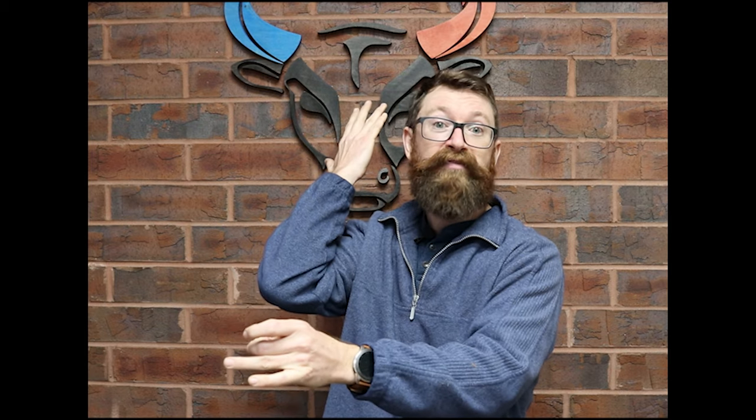So what happens? Either the nail gets stuck — maybe it's a ring shank nail, maybe it's just really strong in the decking, maybe it's brand new. If it gets stuck and the shingle rips up off the nail, not repairable. If the nail is really weak and the head just goes, allowing the teeth of the pry bar to come up off it — if the nails can't come out without damaging the shingles, then it's not repairable.